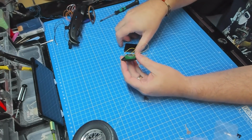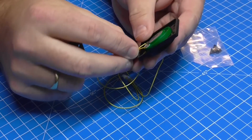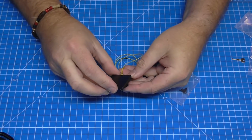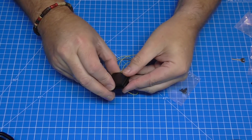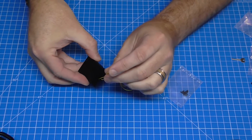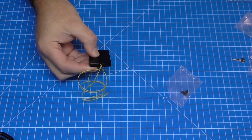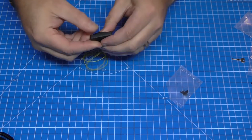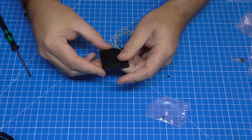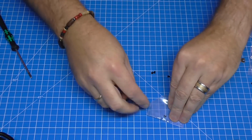We're going to be closing that off with the back of the case here without pinching these wires. So I need to sort of get them together like that. So when I put the top over, I'll put this in gently, they're going to come out of that little hole just at the back there. When I'm happy with that in place, which I am, we're going to secure that down with some of these O screws. We need 4 of these, and that's the speaker encased in its mount, and that's all there is to do in that stage.